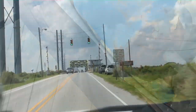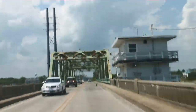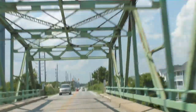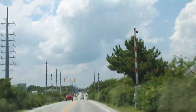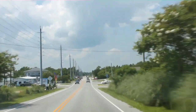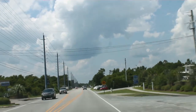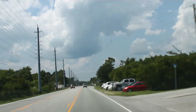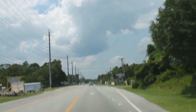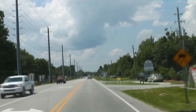I am leaving Topsail Beach now. The homeowner decided to change out the outdoor unit — a dry charge unit — since they were not going to be staying in the place much longer. The biggest challenge is getting it up on a stand as a one-man company, so I'll need to get somebody up there and build some sort of rig. It's not really wise to repair the old unit — even if the dryer repair would have been successful, the unit wouldn't have lasted much longer anyway.